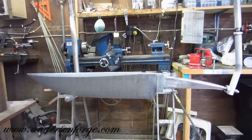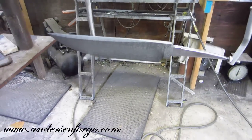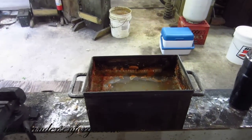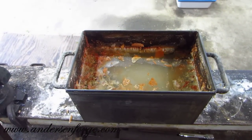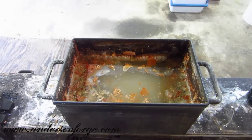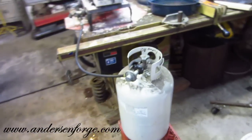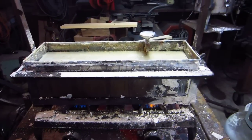So anyway, this is a fighter I'm about to blue, and this is just an assembly I made to lower it in the tank. This is a 10-inch tank — it's only 10 inches long — and in this I blue fittings and even short hunter-type blades, going from corner to corner. When I'm bluing bigger blades, we have my oxygen tank and my propane tank feeding a double burner. And this is a 20-inch tank.